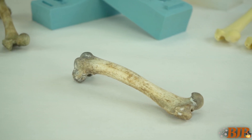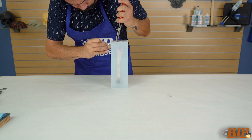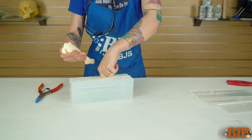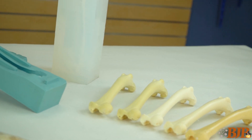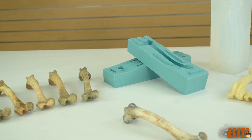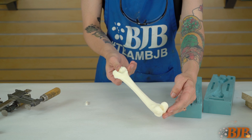One bone with many ways to mold and cast it, depending on your application. Cut molds are a simple way to quickly mold and cast parts. Unfortunately, cut molds often yield fewer casts because of the lower durometer silicone and the difficulty of removing parts from them. They also tend to create more flashing and clean-up work. If you're low on time and only need a few parts, this is a great method. If you need a production mold that will yield more castings and produce cleaner parts, a two-part silicone mold is worth the effort. Being able to use a higher durometer silicone allows you to run both foam and resin parts, maximizing the usability of the mold.